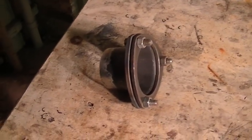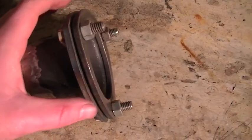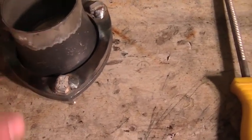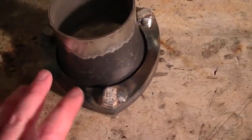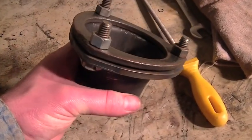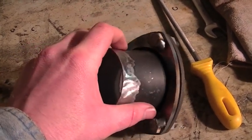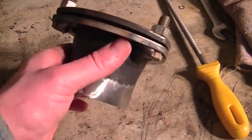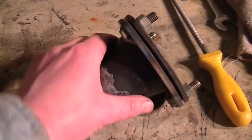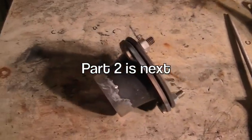I'm just about ready to pull the manifold off the grill and start welding this thing together. What I did is take the other 3-bolt flange and bolt it to the one that I welded the bolts to, really just to hold it in place, and also so that I don't forget to put it on there. Because once I stick this piece of tubing on the flange and start welding, if I forgot to put that 3-bolt flange on there I'd have to cut it off — I won't be able to get it on otherwise. So let me go get set up, get the manifold off the grill, and we'll get this welded on.